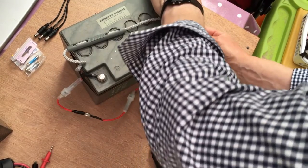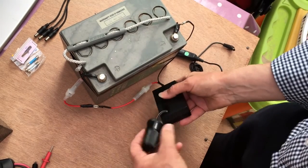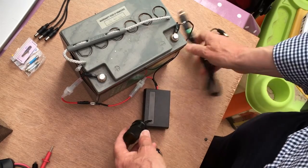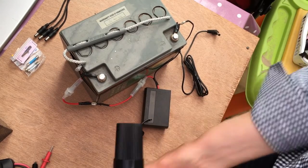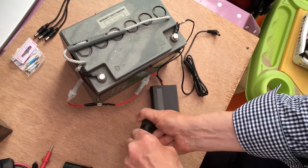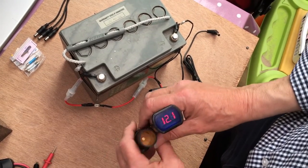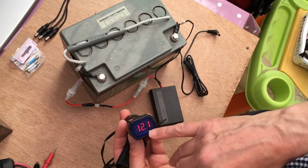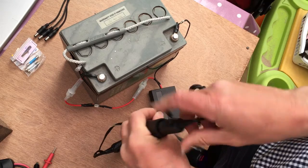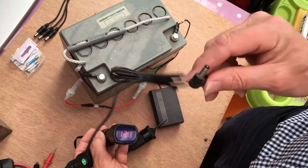Connecting up the battery to the voltage regulator is fairly simple — the spade terminals go together. You have to be relatively careful with that, don't be cavalier about it. So now we'll have 12 volts available here. Let's try the double-barrelled one — that should tell us approximately... there we are, it's got 12.1 volts being delivered. We can now plug the real lead in and power the circuit we're dealing with through this.